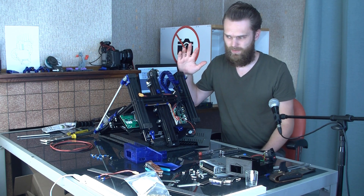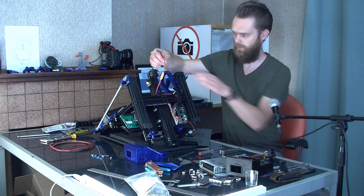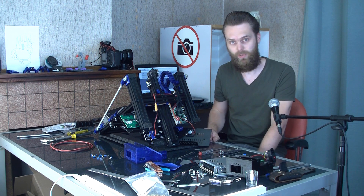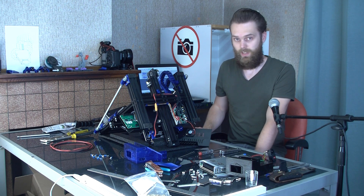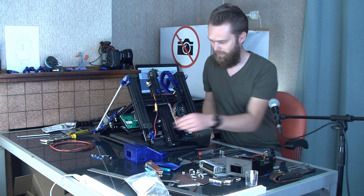First, I want to share a couple of things regarding safety. It turns out that this connector, the XT60, can be a fire hazard when current is flowing through here. The problem arises when you use a higher print bed temperature and print more difficult materials like ABS and nylon for long periods of time — and that's exactly what I want to do, so I reckon this can be a bit of a problem for me.